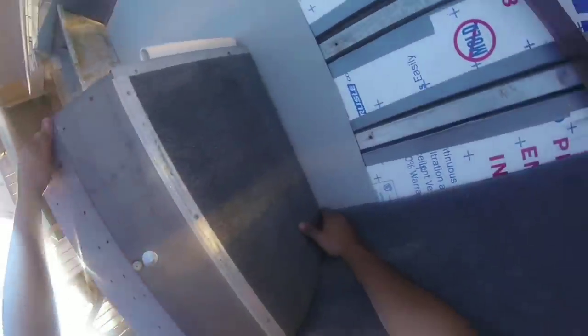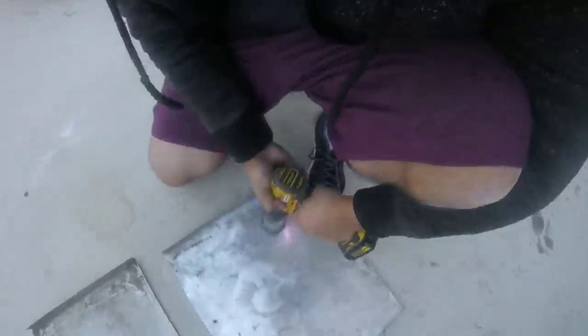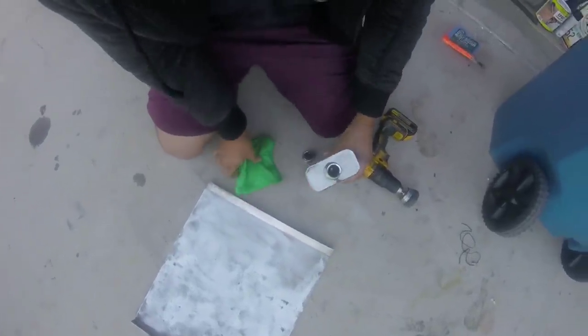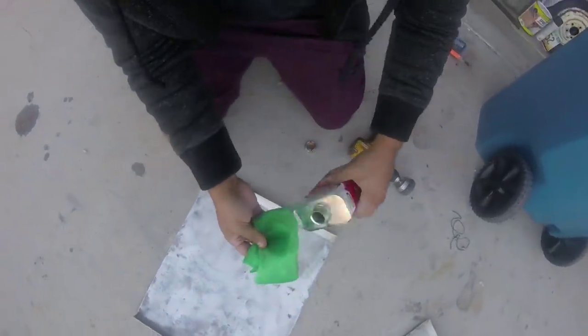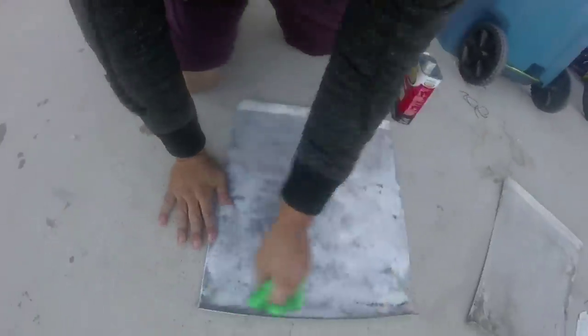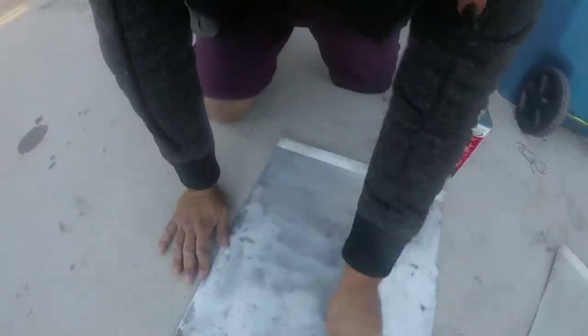Strangely it almost sits — because it's so close, it's lower than before, since there was a three-quarter inch piece of wood. One thing I forgot to mention is that you need to clean the aluminum, or at least clean the surface, even if it's painted. I'm just prepping this aluminum right now using acetone to get off the rest of the contaminants after I hit it with a wire brush. Acetone is the one step you need to use before you apply it to any aluminum surface.